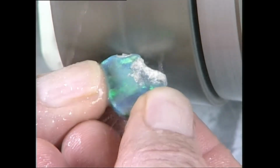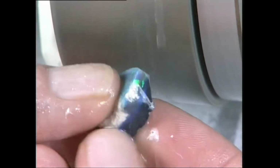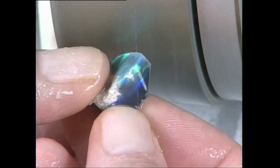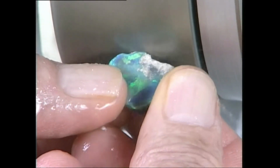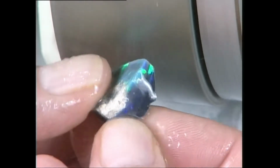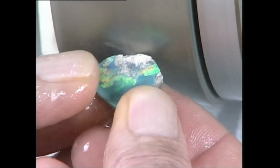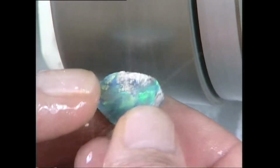Grinding gently until we get the sand to show halfway up the colour bar or above the colour bar, making it possible to roll it out during the doming. Still a bit of sand there. Fairly clean now. This area here is quite a large problem. We will have to take the right hand side of this stone off with the saw, I think, rather than grind this right hand corner away there.